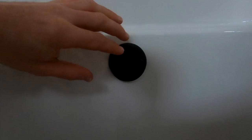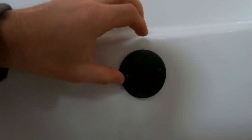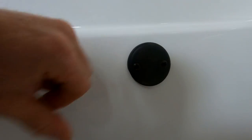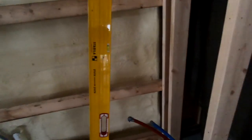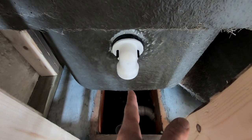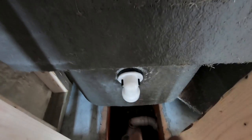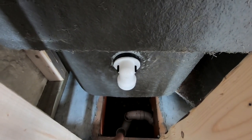This is the piece that goes on the tub. There are two screws — there are little clips that come with most of these that hold it on, but you don't usually need them. Just get that snugged on there and get it as vertical and straight as you can, so you know it's going to go straight down. We're going to dry fit, get it cut, and then make sure it lines up with that pipe down below.